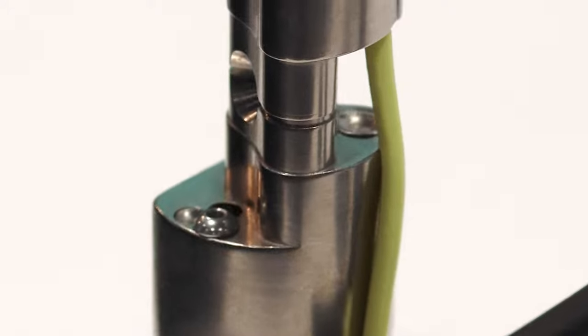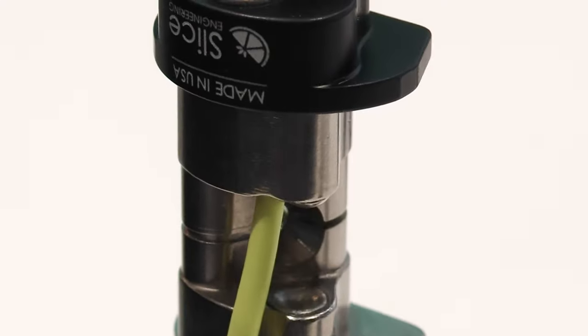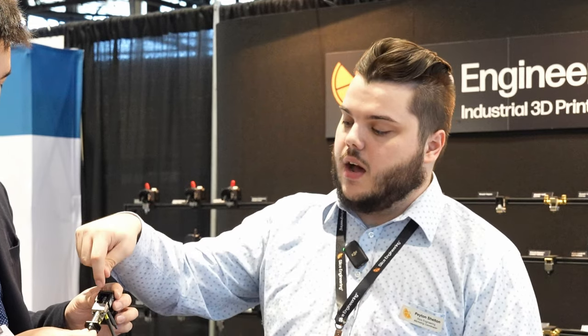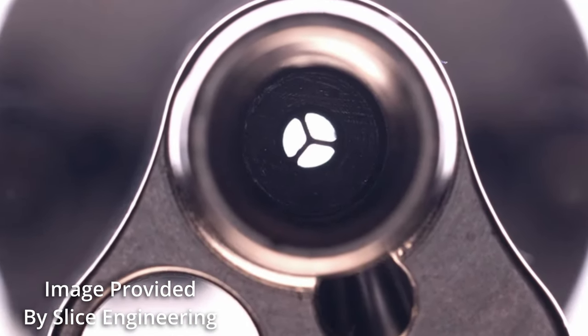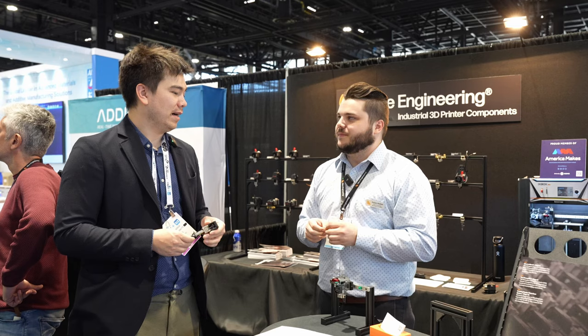Is there any secret technology inside here that you can share with us? Not secret, but there is one more thing I forgot to mention that is pretty cool. Inside of the melt zone, there's an internal flow-splitting die. It kind of looks like the Mercedes logo — it's this very sharp, almost knife's-edge shape that, as the filament's coming out already molten at the bottom, it's going to break up the flow to make it more laminar. That increases the flow rate further, and that's part of how we achieve that 116 number.